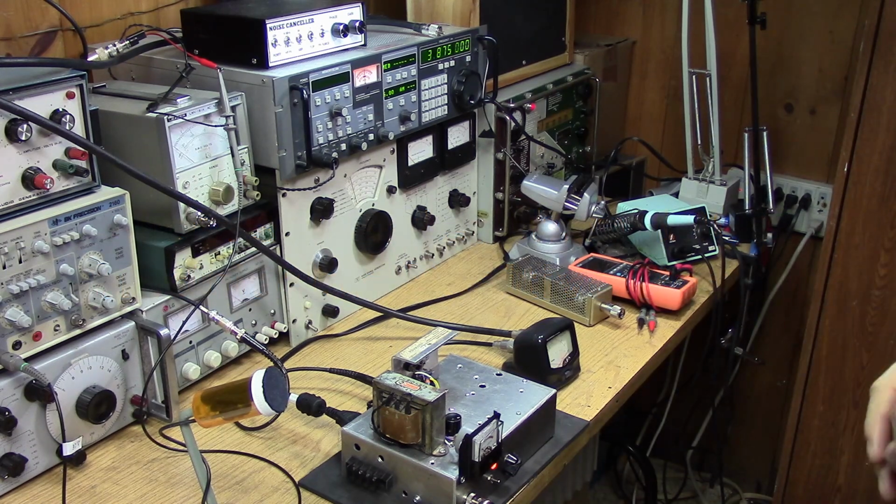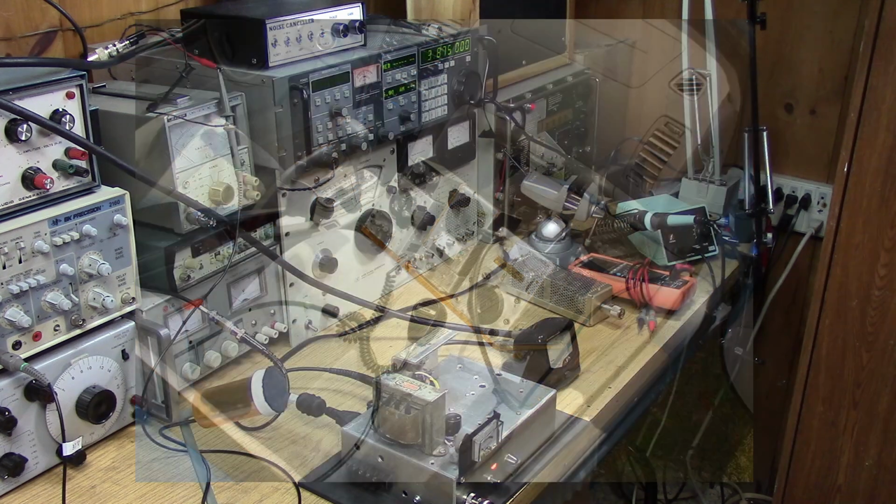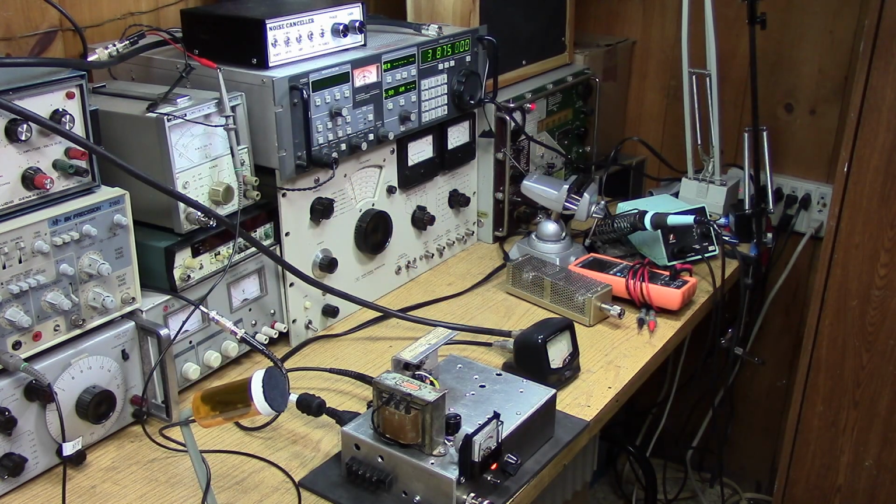You're up to 20/9 in Natick, which is excellent for your power level. And the audio's not bad. It just needs a little bit more to get through the noise floor of 75 meters. So looking at your QRZ photos, we may have met in person at NEARfest. I like your mobile setup. So good job on getting the PDM going, and yeah, I set the duty cycle for about 40%, and then you can get a little bit of positive modulation on that. So WU2D, W1DAN.